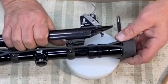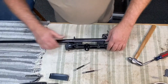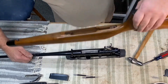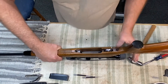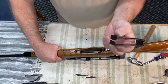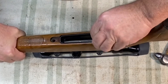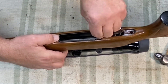It's all the way through. Safety moves. Now you've just got to put it back in the stock. Squeeze this all back together. When you put this piece in, it's spring loaded. That has to go down all the way in to where this part's flush. You've got to make sure that it's kind of squeezed together, or otherwise the trigger guard will not go back on. And you'll be spring cussing.